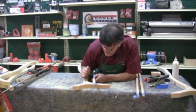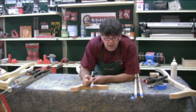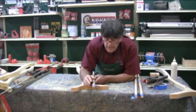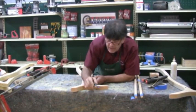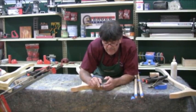If you go back and look historically and start dealing with a lot of old antiques, what you're going to see is most of the time the tenons let go because they shrank. Or even though this is very narrow and very thin, there's still going to be a little bit of seasonal movement. Now, the thing this does inside of there, it will allow this to flex just a little bit and keep these sides in contact. Now, this is a minor thing, but if this tenon shrank or this decided to expand any, this would allow it to move a little bit. If that little cut wasn't there, then if it moved, it's going to break the bond. It has to. Something has to move.